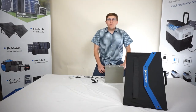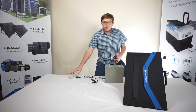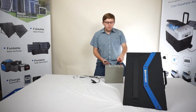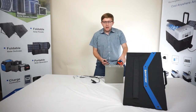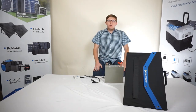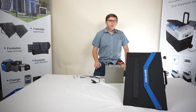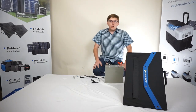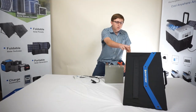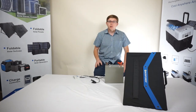When attempting to charge a battery with the solar panel, please be sure to follow these steps. First, make the connections with your charge controller to your battery. Connect the red alligator clip to the positive terminal and the black alligator clip to the negative terminal in this order. The reason for connecting in this order is because the charge controller can operate with both a 12 or 24 volt system. The charge controller must first recognize the battery voltage before the solar panel is exposed to the sunlight. This will ensure that the charge controller operates at the appropriate voltage range.